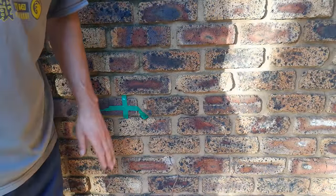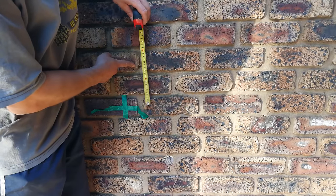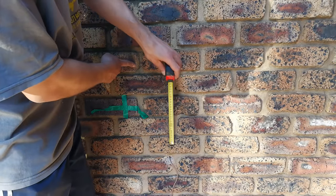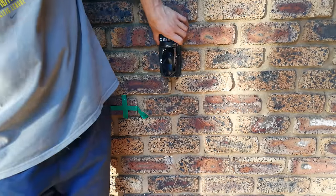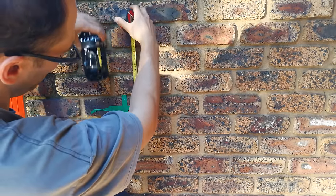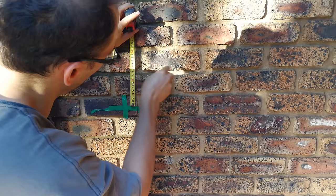Because it's too low on that side, I've measured 15 centimeters and I'm going to lift the beam 15 centimeters higher, so it's actually going to sit there. The new reference point is going to be here, in line with where the power wire is going to come. The power wire will go up the wall like this. Measuring 15 centimeters up from the reference point — we're going from the reference point up 15, which is there — so that's the new reference point, and that's where the sensor is going to go.